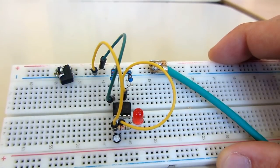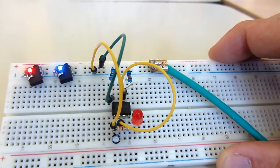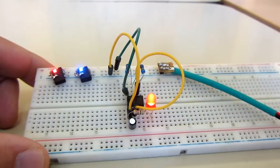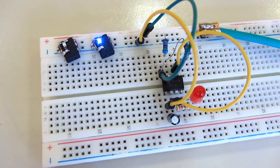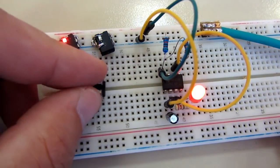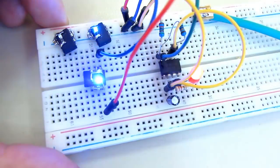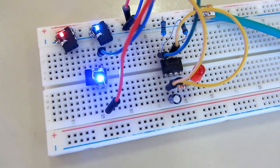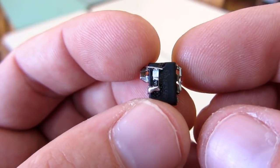Components are 3 resistors, 1 capacitor and 1 LED. All components except the 555 timer are surface mount components that you can find on eBay. Size is 0805. The circuit can be used on a breadboard directly. You don't need jumper wires anymore. If you have a boring circuit on your breadboard, you can just add a couple of these to add blinking fun.